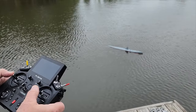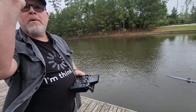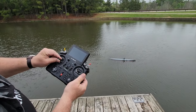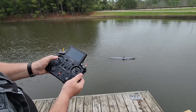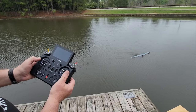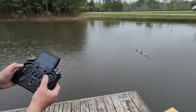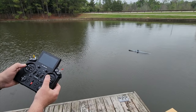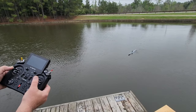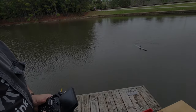And actually, this makes sense. Now, this would probably work really, really well for U-boats and stuff with the rudder behind the prop. Because what I'm doing here is this is fore and aft throttle. And that unused channel, channel 4, that's a differential. Now, this is differential alone, you see? But now I give it the rudder. That kicks it right over. And you can adjust a little fore and aft because they're mixing. Yeah, that's what I was doing with SeaView. You have to go a little bit forward, a little bit back. But once you get in a groove, you become a docking pro.